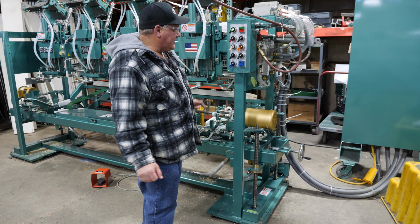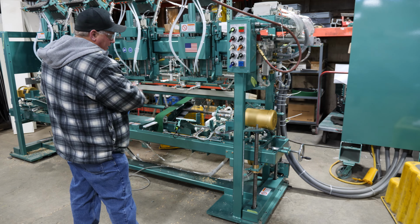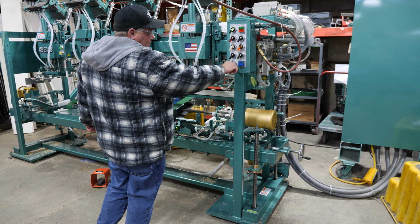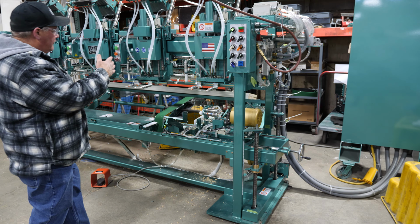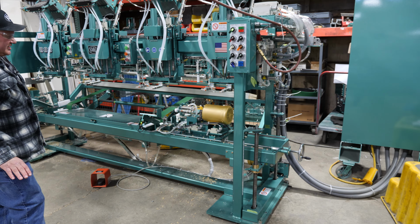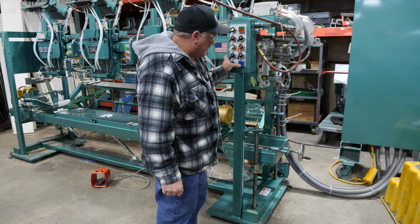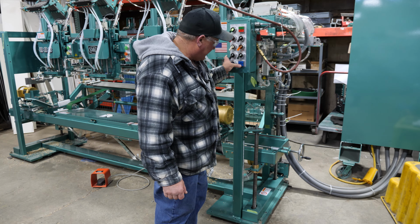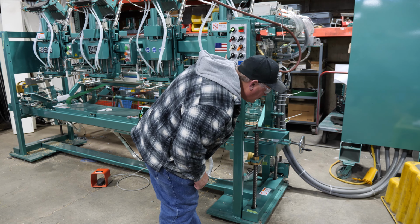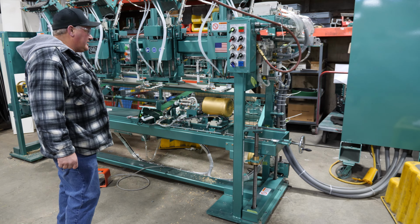Okay, so now to run my 6.8 door, I'm going to turn head number 4 off, and you're going to watch the drill go in. Your right side drill is going to go in to make down to a 6.8. So when I turn that, you see the head shift over for 6.8, and then your ball catch shifts over. Okay, so we're set to run a 6.8, but before we do that, we're running an 11 3/4 door. So I close it up, and then come up to 11 3/4 right there. I'm at 11 3/4, so now I'm ready to load my hinges and set my door in there.